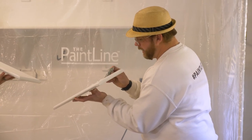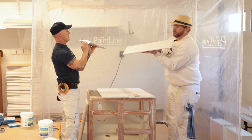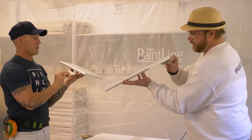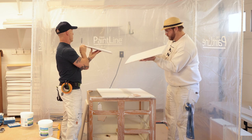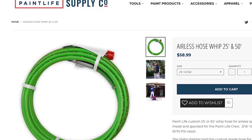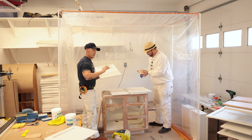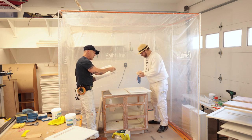What kind of pump did you use when spraying it on? I used a Titan 440 — probably from the late 90s, one of my old pumps. It was given to me by a painter when he retired. He said if I clean it right it will work until I'm done painting, so I clean it real good every time. I used your 25-foot 316 green hose and a 310 purple tip. We're just cruising right along and I'm giving Michael some pointers — I don't like to work with a lot of product, just a little at a time.